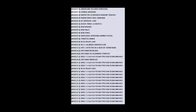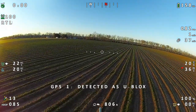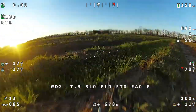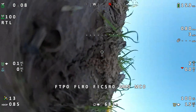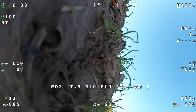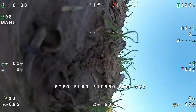ArduPilot retained its previously set home position. With everything rebooted and shut down in the air, I switched to Return to Home as a last resort, hoping something might come back. It dropped right into Return to Home and started to glide the airplane — leveled everything out, and the airplane was gliding back home. I actually got video back just before it hit the ground. I'm pretty confident that if the motor and speed controller had still worked, it probably would have flown itself back and circled overhead.